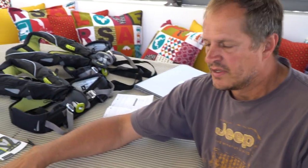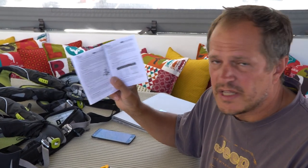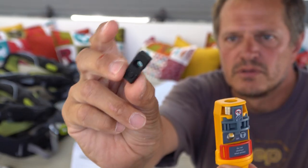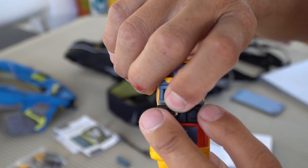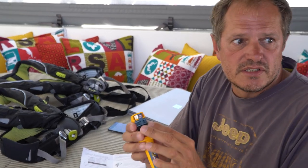I've programmed all of them, so all these little devices are now programmed. The AIS was actually quite easy to follow with the instructions. The website version doesn't work, so you must use a PC - the browser version just didn't want to do it. It was just a matter of taking this little black thing that comes in the packet, placing it over like this so that little light is exposed to the screen, and following the instructions. It programmed through the desktop program, not through the website. The website kept flashing red meaning failed programming, but on the laptop it worked and flashed green. The MMSI number is programmed into all of them, so they will call us on the radio and also transmit AIS man-overboard. We tested it - all four are now programmed.